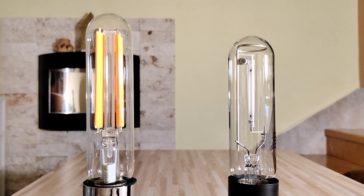This LED lamp isn't dimmable, but this HPS lamp is dimmable. And for this LED lamp you will need only the mains. But for this HPS lamp you will need some magnetic or electronic ballast.